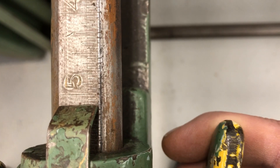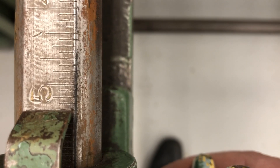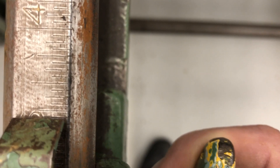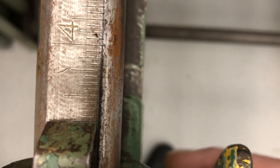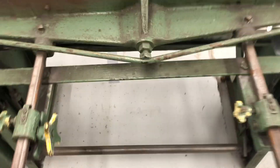I'm going to go over to the other one and set it at four and three-quarter as well. Where's the big line that shows the five? There's the big line. Each mark here is one sixteenth. One, two, three, four sixteenths — and four sixteenths is one quarter of an inch. So five minus one quarter is four and three-quarter. Lock that hub and the machine is set to cut.